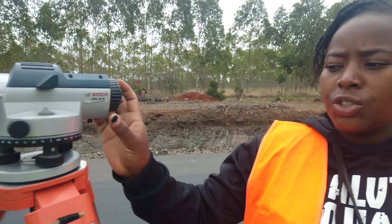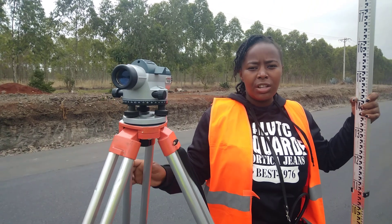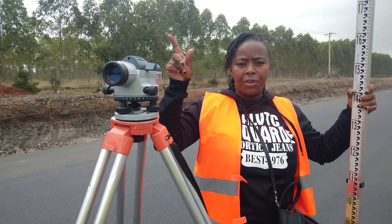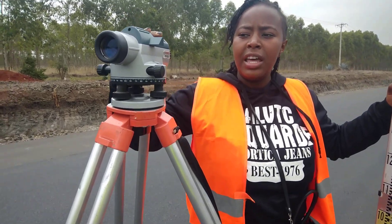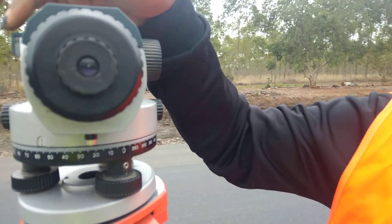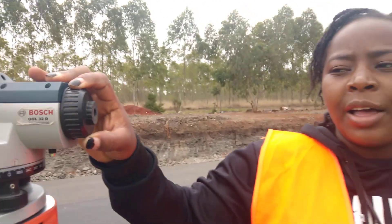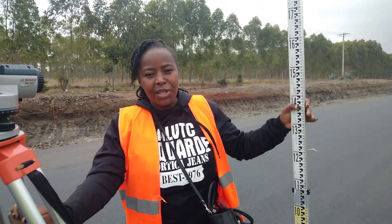When you're reading, don't touch — don't put your hand on the staff or on the stand, because it's going to affect your reading and your bubble. Here is the mirror that I was saying — you normally check it to see if the bubble is at the center. So, thank you again for coming to my channel and learning something new. Goodbye.